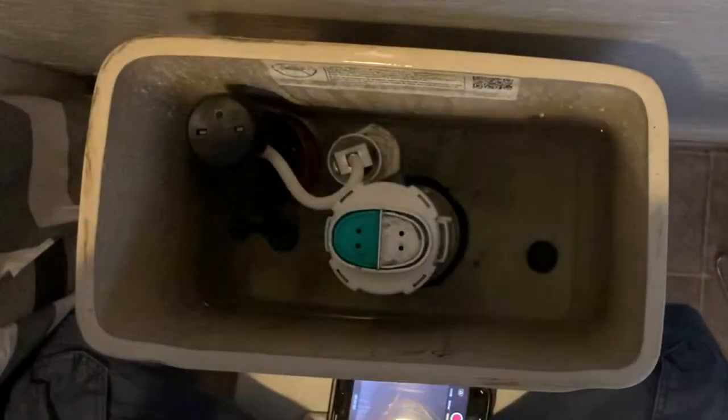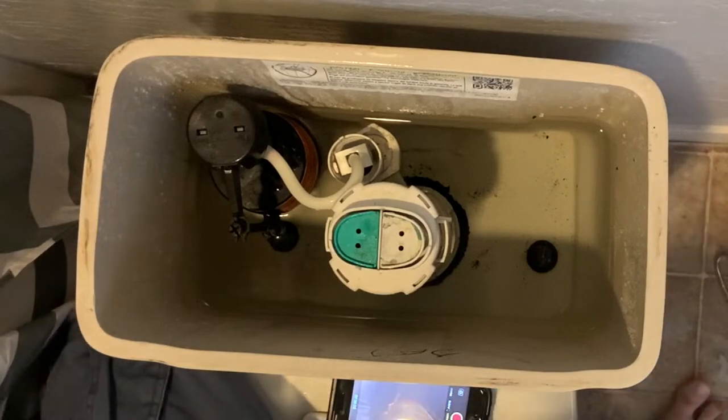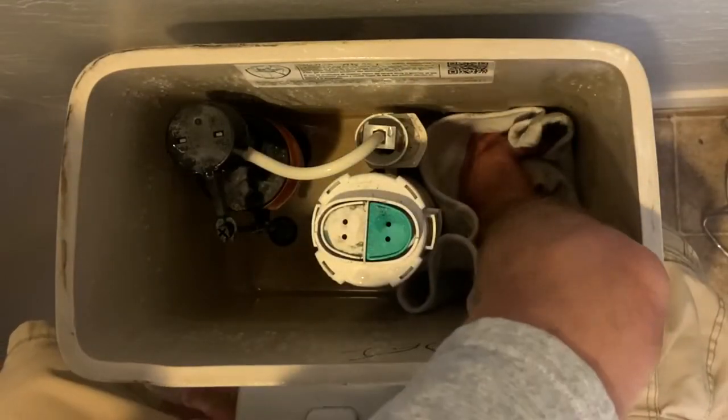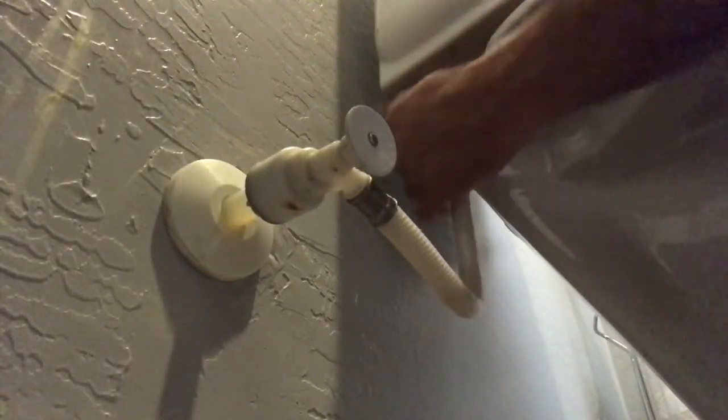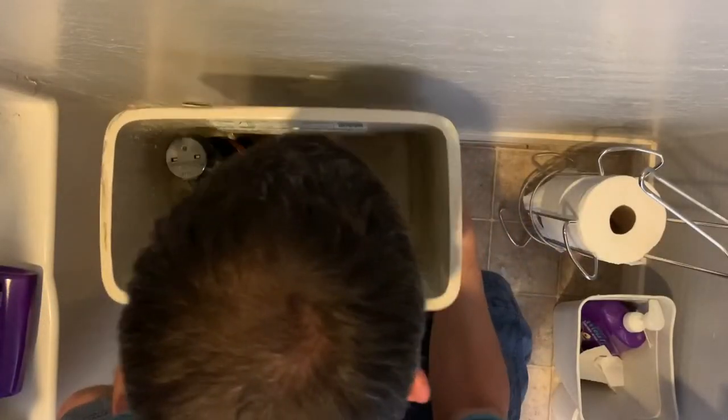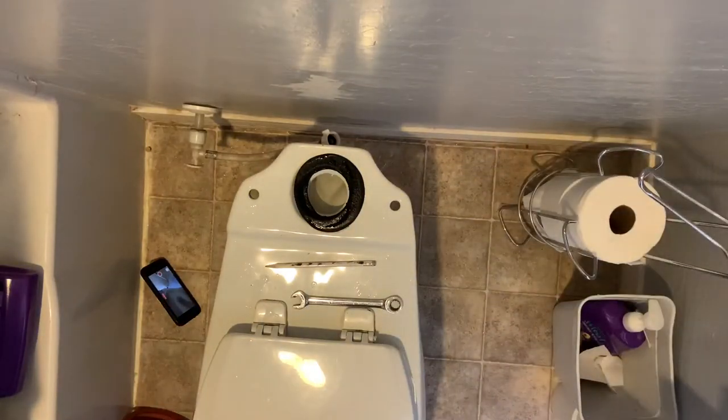Then you will need to take the lid off of the toilet. Make sure you lift it directly up, because you don't want the rods attached to the push buttons to hang up on the flush valve and possibly break them off. Then I marked the water level of the tank being full, pressed the half flush button, let that go down and marked that, and then the full flush button and marked that as well, so you have a reference for going back together. Using a towel I removed the rest of the water in the bottom of the tank so when we remove it, it does not make a mess. Then using a ratcheting wrench I removed the two nuts holding the tank to the bottom of the toilet. After that I pulled the supply water hose off the tank — I was able to loosen this by hand, but you might need pliers to break it loose. Then lift the tank straight up and off of the bottom part of the toilet.